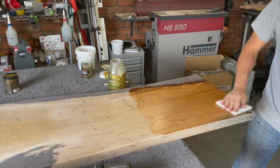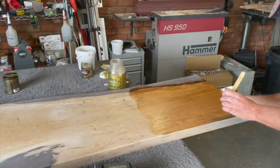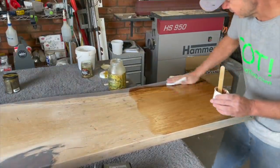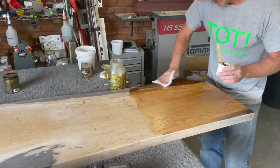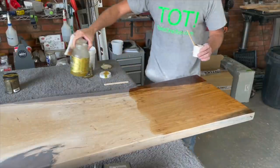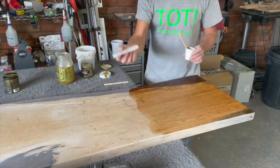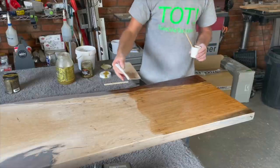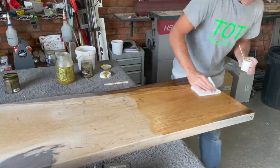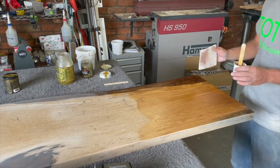It's not a dye — my hands are completely fine. It smells fantastic, it's not sticky like an oil or a wipe-on poly. It goes on the resin brilliantly and doesn't leave a film, which makes the resin side easy. To speed this process up, instead of using your scotch brite white pad you can put it on a power buffer — you're going to see me do that now — and that's just going to massage it into the grain. Use a tiny amount, or else you're going to spend ages wiping it off.